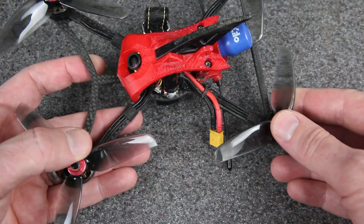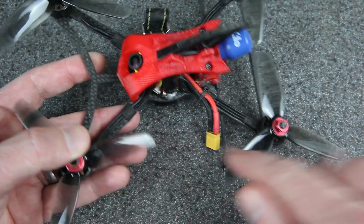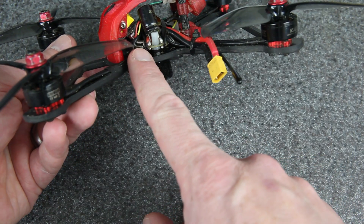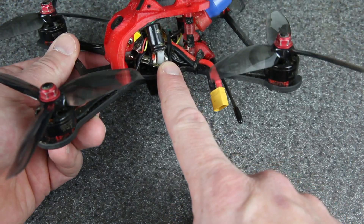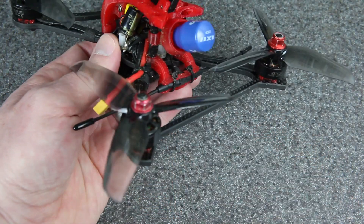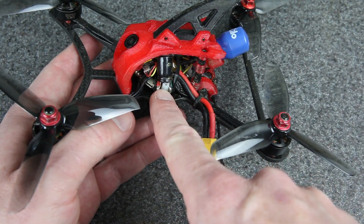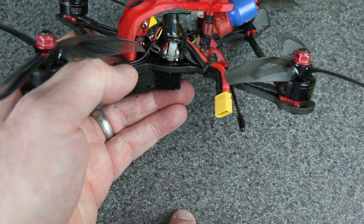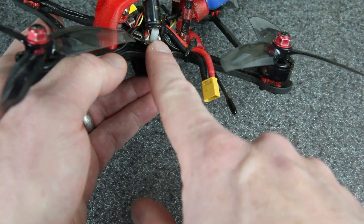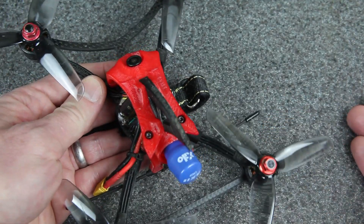Here's another example. This is a four inch racing drone — the frame is the Twig Mutant R by RacerX FPV. The flight controller I've got in here is a 35 amp all-in-one board from BetaFPV. The USB — if I had mounted it forward — would have been blocked by a post in the frame, so that combination just didn't work out. I had to rotate this flight controller 90 degrees, which is why you can see the capacitors on the side. I always put the capacitor there rather than out on the power lead. Since I was rotating the flight controller and the power lead was coming out on the side, I decided to plug in the battery from the side as well.